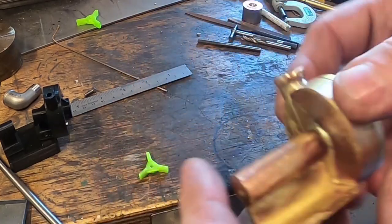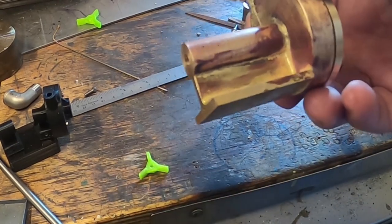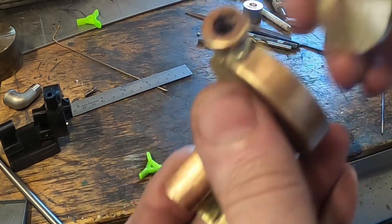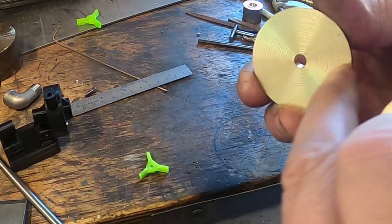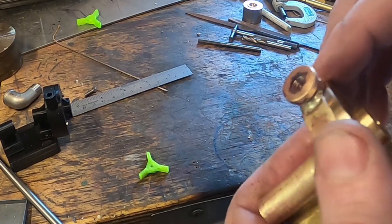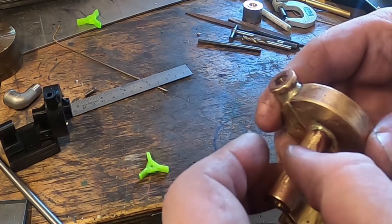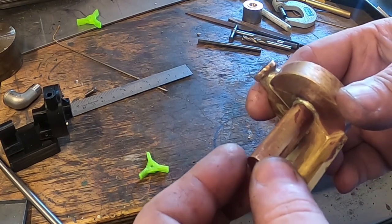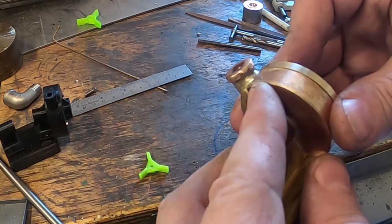Now there's a couple of jobs we can do. There's heaps to do actually. But first job with this, I think, is to set this up in the lathe, put a chamfer on it, or put a shoulder on it so that it fits there. Put 10 holes around it. And then chop this in the middle and clean both pieces up and put 10 holes around there to match, so that it's actually bolted on there.